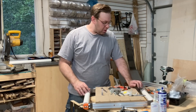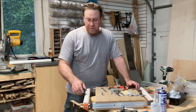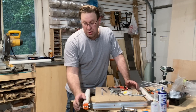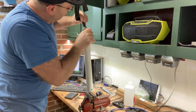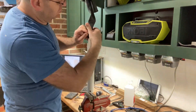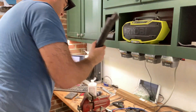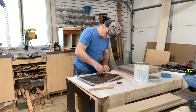Now the front and back rollers are on and both run freely. One side will have the motor; the other is free-moving so I can adjust belt tension. I need to trim these down and get the belt on to see how it works. I then realized the PVC pipe was too smooth and the power feed belt was just going to slip. So I took some old bicycle inner tubing and slid it over the PVC pipe — isopropyl alcohol was the best way to help get it on.